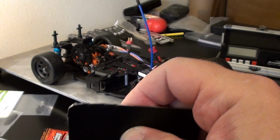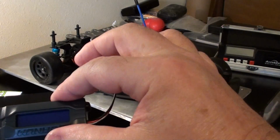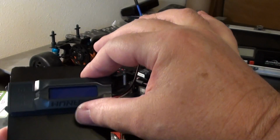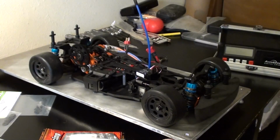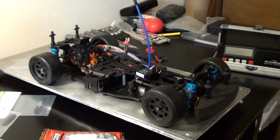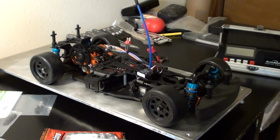That's 40 thousandths and a small part. Oops, sorry about that. It's designed for the GPS. That's going to be pretty stiff when you cut it out. And I'll use a pair of air shears, or excuse me, electric shears to do that. They give you a nice clean edge, just like you took it to the sheet metal shop and had them put it in a shear and cut it either by foot actuation or pneumatics.